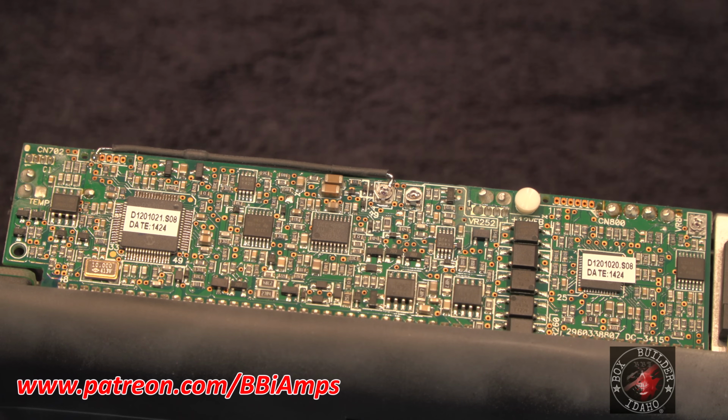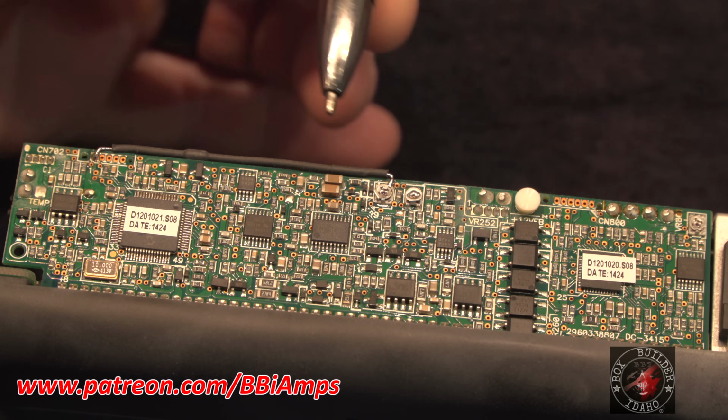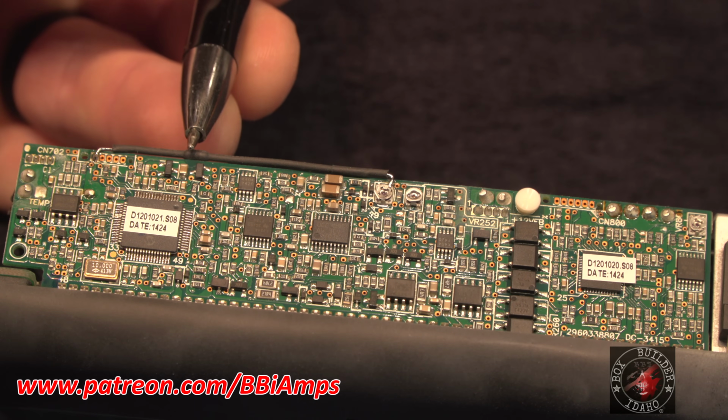So at 15K, we end up getting 14.2 volts, and that's with this knob maxed all the way out. Now I went on to play with it because, I'm sorry, 14 volts wasn't enough. So then I dropped the 15K to a 12K, and that got me to 14.9. So 14.9 max volts here, adjusting here to max volts. What we're adding here is a 12K resistor. Well, that still wasn't enough for me. There's two parts to this equation. I'm just going to cover it in its sequential order. This is a 9K resistor that's in here now.